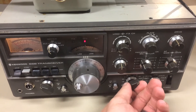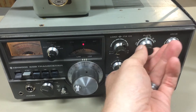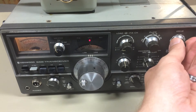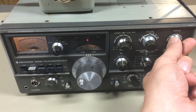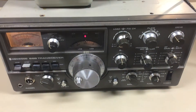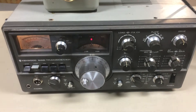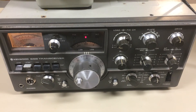This is much more pronounced if I go on the lower bands. For example, 7 MHz. Let's reset the plate here. You can see, for quite a range of rotation of the drive control, the ALC reading is beyond the range of the meter. And if I take the center of the range where it is off scale, roughly right about there — if I call that my peak of the drive, I can proceed and tune up the rest of the radio, and it does operate normally.